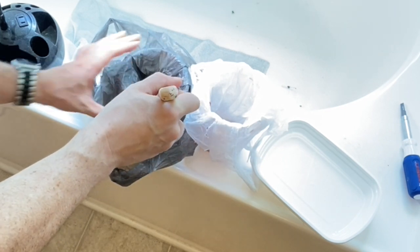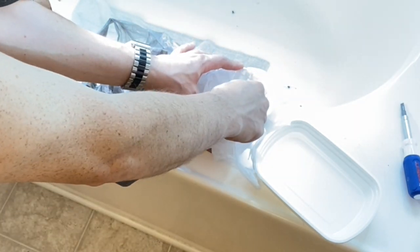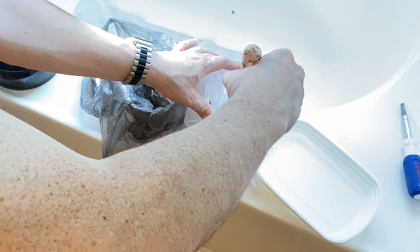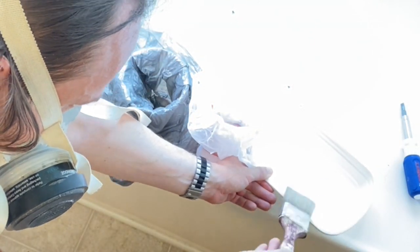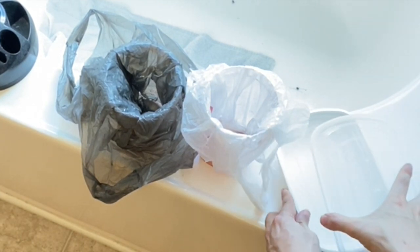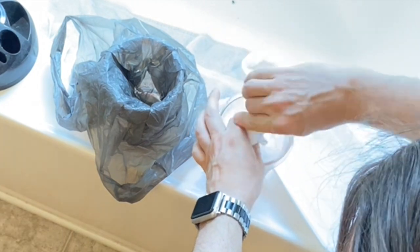The difference between the 3 containers is more obvious if you do this with stain. But with the clear or nearly clear polyurethane, the difference is less visible. Nonetheless, keep the containers in order. Once done with all 3, seal the containers with lids. You should now have a brush mostly free of polyurethane or stain. Now, you just have to wash off the paint thinner. This, water can do.